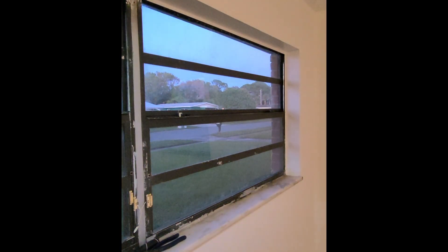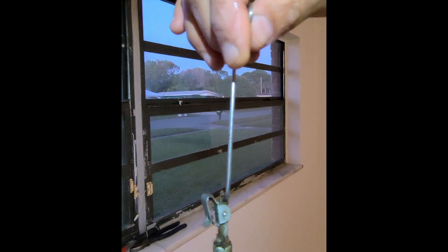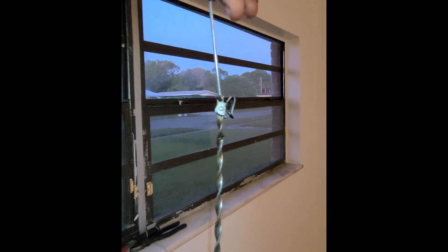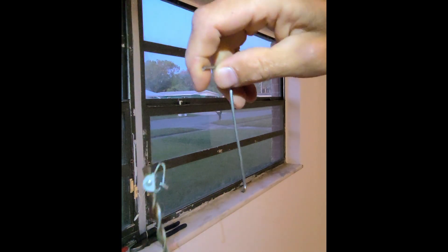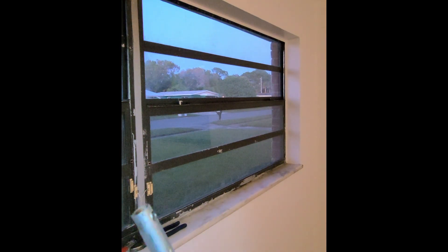That is that style. With this style you have a tool that winds these clips — you can see it there. This tool goes inside of the end of the spindle. You've got to add tension by twisting it. Rule of thumb for these particular ones is about seven turns. You can go more if you want, but that's how you add the tension in. Clip this around the bottom of the window and you are in there. The top just screws into the frame. Pretty straightforward, but if you haven't done these before it might take you a little while — so be patient.